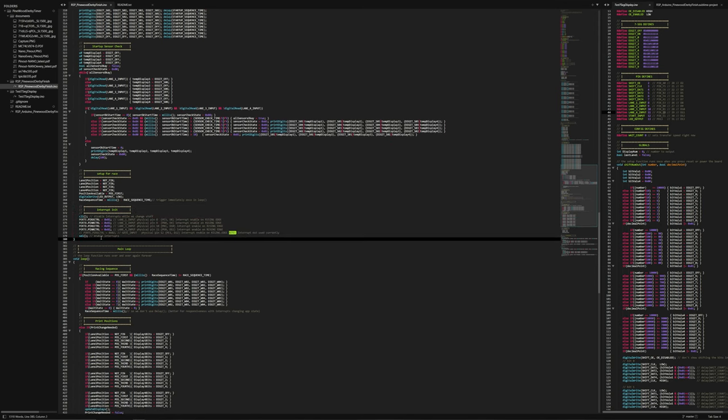And this is also another point where I had to struggle a little bit, because I looked up a bunch of tutorials for doing interrupts on pin changes, and they're all great, but they all did not work for the Nano Every. So I had to actually start going into more of what I do for my job, firmware, and start digging through the data sheets and looking at what processor I have. Then I basically just referenced these registers directly in order to configure the processor to have the interrupts work like I want. But overall, it's decently simple. Other than that, I now realize that with how I had the pins set up, two of them are on port E and two of them are on port B. So we're going to have two different interrupt service routines for those. But that's all good and dandy.